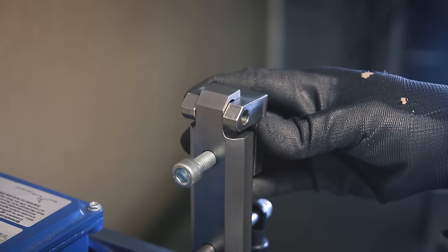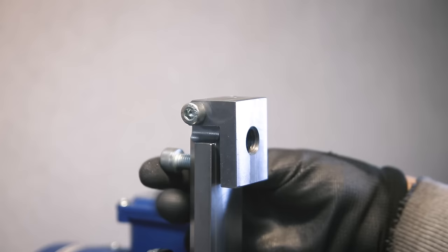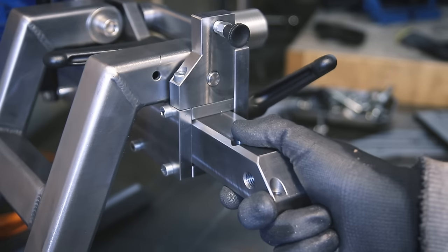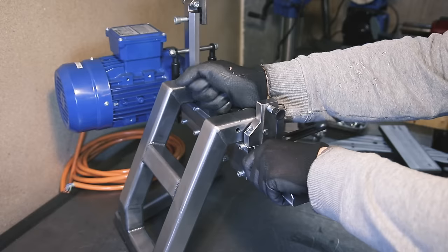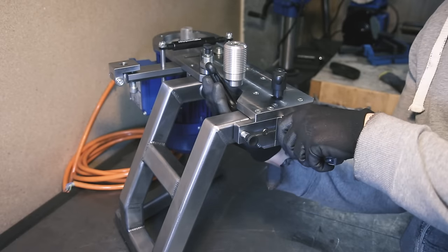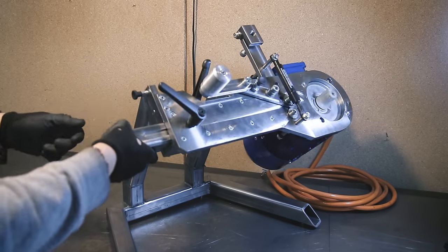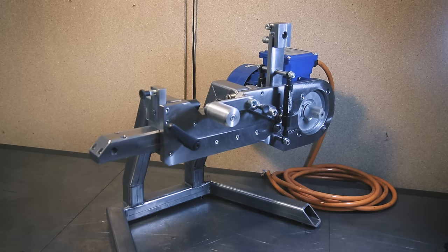Now let's install that little hinge thing for the tracking feature. The tracking wheel tilts up and down by adjusting this bolt, and of course that's going to be replaced by a nice handle. We are now nearing the end of the first video, but before that I want to show you the tilting feature. It uses two separate locking mechanisms: there's a locking pin which automatically holds it in place when you flip it up into horizontal mode, and then you can use the big lever to lock it down tightly. The same principle I used on the tension lever - you just flip this up and it stays there without having to hold anything. When everything is done, the machine will be balanced so that it stays in the vertical position by default due to its own weight, so it's always either locked vertically by gravity or horizontally by that pin.